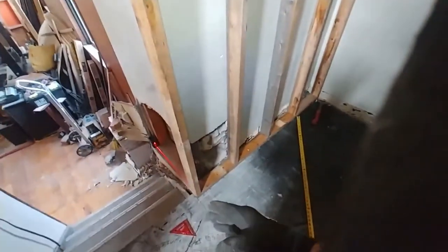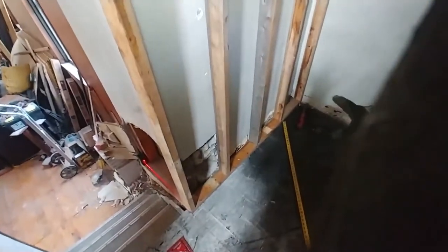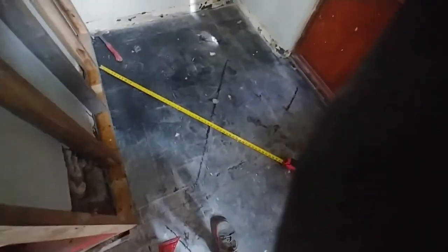And then I took a measurement here, what I had for floor to there, made it a little bit shorter, and I built a wall on the floor the way you would for a new build. So this has the same exact length plates on top and bottom. All the studs are the same length. I slid it in here until it stopped on this chalk line, right? And I could pin it there, but I still am trying to be at 90 degrees from this chalk line now.